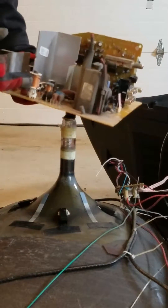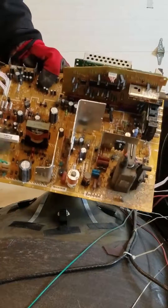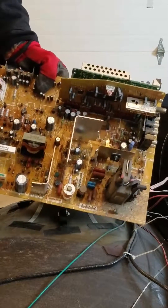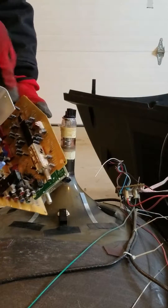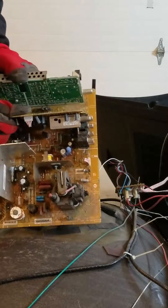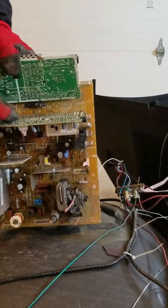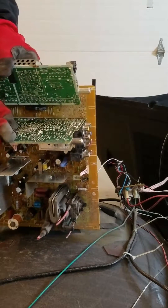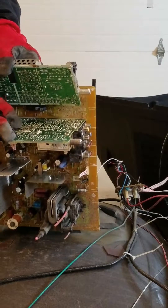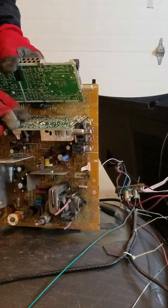Here are a few more pieces of copper — all of the copper you want to remove so it can be taken from its coil and later scrapped. Every one of these boards will have little ceramic capacitors called MLCCs, listed by the letter C on the board. They're little brown chips that contain platinum, palladium, and silver and can be removed for later refining.